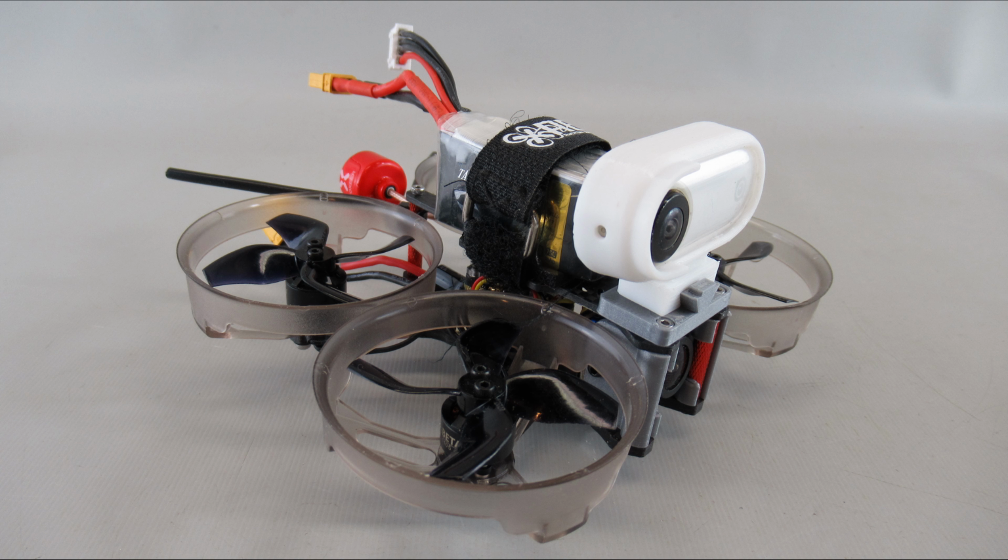Alright, so after I got the motors put on, plugged in, got the ducts on, everything up and running, passed the smoke test, got a good VTX feed to my goggles, then it was a matter of setting up the parameters in the OSD, setting up my switches on the transmitter, getting that to match up through Betaflight, and then obviously you go to check the motors. It turned out not only were my motors going the wrong directions, they were mapped to the wrong configuration. Your normal lower right number 1, upper right number 2, lower left number 3, upper left number 4 wasn't mapping correctly, and so I had to figure that out.